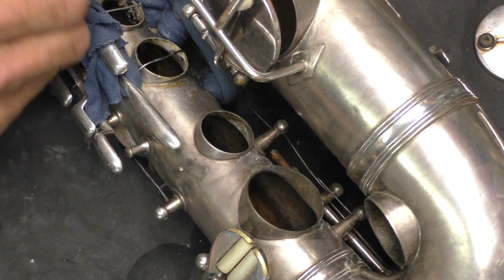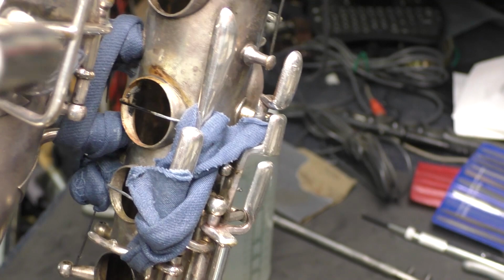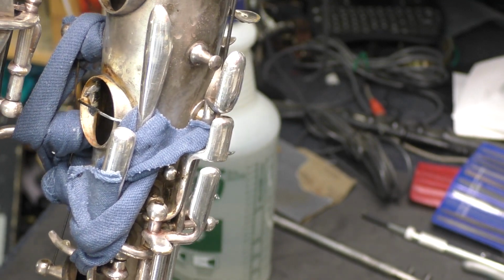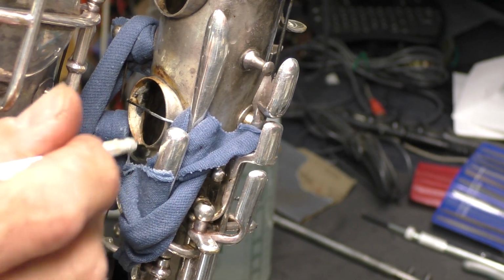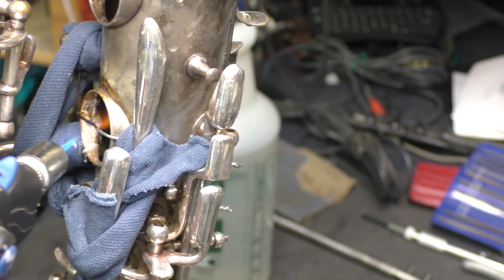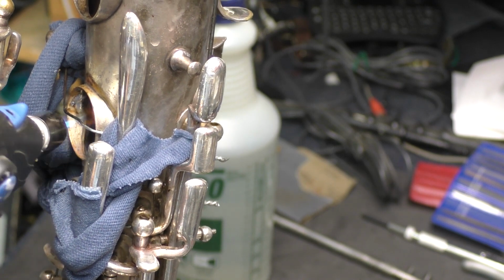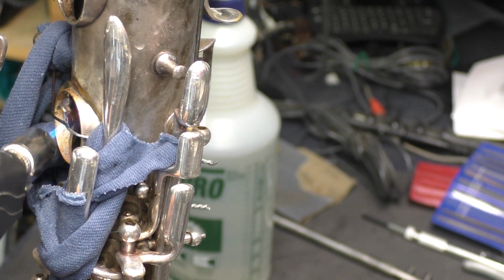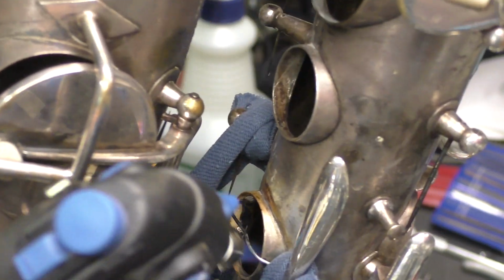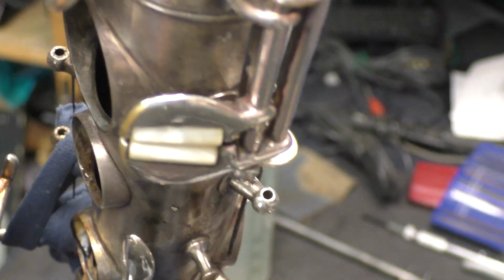More flux on everything. I've got a lot of solder in that hole. If I could get it to flow downhill a bit, it would do wonders. Let's get a little flux going here, which will kind of help guide it. The filler metal is always going to follow the heat. Remember that when you're welding with gas. Okay, let's preheat that area. Now let's get some heat on this area, and I should be able to kind of paint it along with the torch. I grab the flux right now, give it a wipe, tilt it some more. I hope you can still see this.